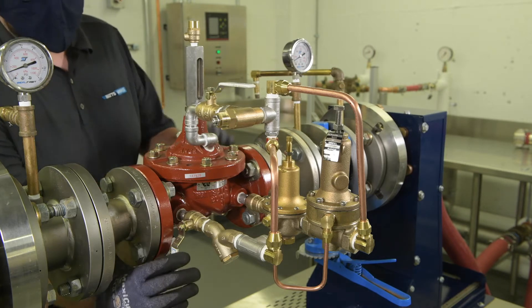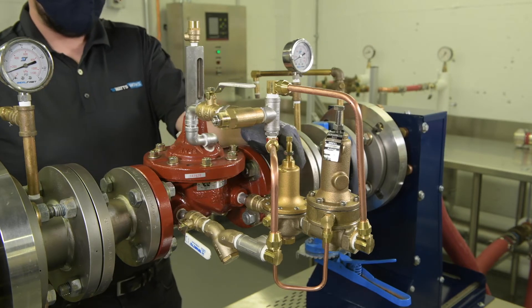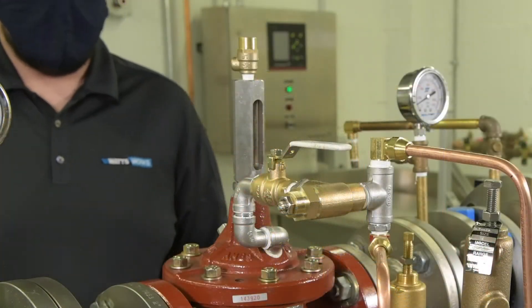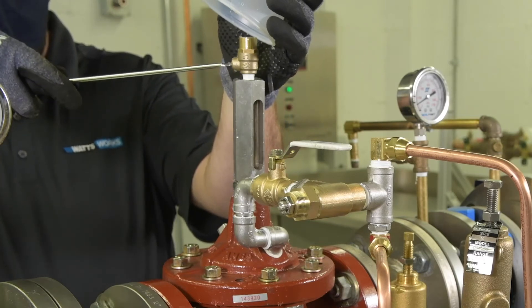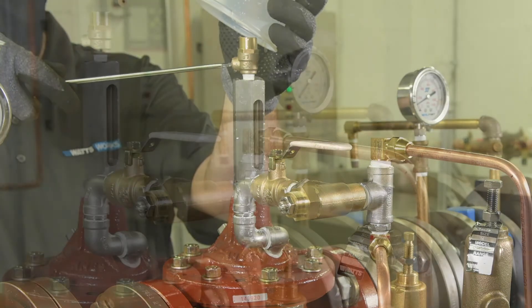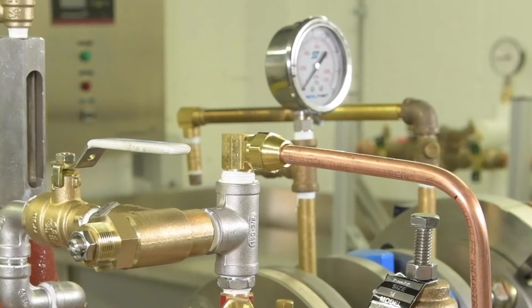Open the inlet and outlet shutoffs in the pilot system. Before setting the pilots, all air needs to be bled off the valve cover. Open the bleed valve and allow air to vent off the cover. Repeat this process until all air is bled and a steady stream of water drains from the system. If your valve does not include a bleed valve, loosen the highest fitting or plug on the pilotry or valve and allow air to bleed. Tighten the fitting or plug once all air has been bled.